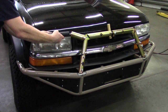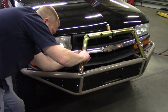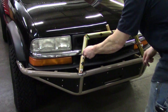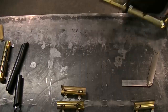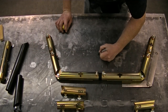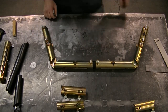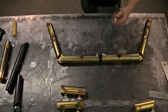Now I can bring the bend a little closer to the cope and that's going to look really good with the final tube radius in there. I can line up the rotation for the copes using the slots in the tube jig and eyeballing those with the center of the tube. Then lock the whole jig down and measure the cope angle. The final numbers ended up being 21 inches between bends—a little longer—legs are 11 and a quarter, a little shorter, and the cope angle is 21 degrees. I can then measure the overall length of tube to bend, add a few inches, and it came out to be 48.